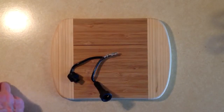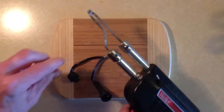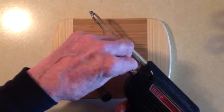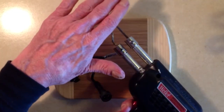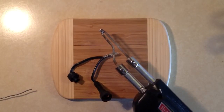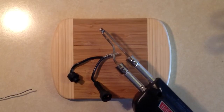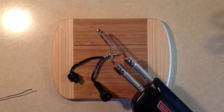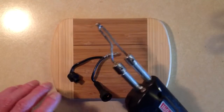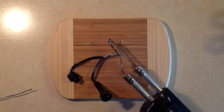Get a little solder out there. Then what you want to do is start up your soldering gun. These little bulbs in this soldering gun don't seem to want to light up for some reason — there's an intermittent connection in the bulbs, but it's not intermittent in the heating element. If the heating element in a soldering gun like this fails to heat up adequately, the first thing you should do is make sure that these connections here are tight — they use those little hex wrenches, and you need to have a set of those to get in there and tighten them up. I'm running this soldering gun now for a good long time until the tip gets very, very hot.